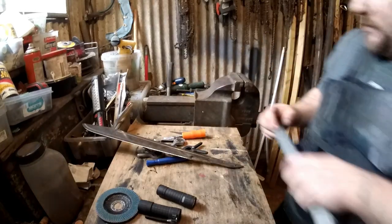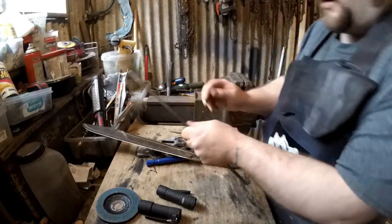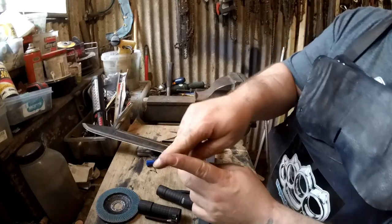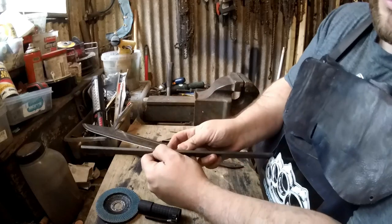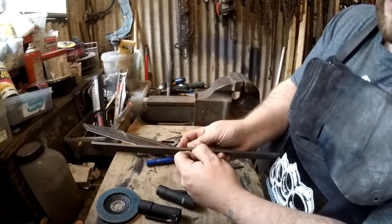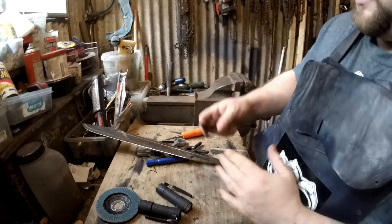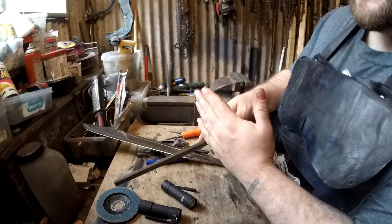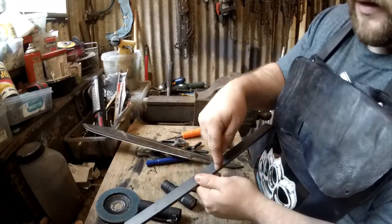So it will be a mild steel guard, quite a big guard, probably about that long. And I'm going to attempt to bend one bit of this to a 90 degree, cut a little slot in this, file a slot in this a little bit, and a slot in the top of the one that's the 90 degrees. They should be able to fit into each other then, and be level. And then I may be able to put a little rivet in.